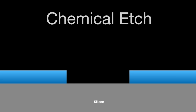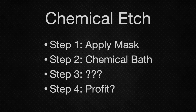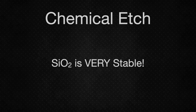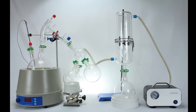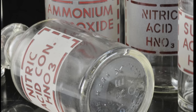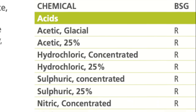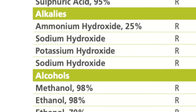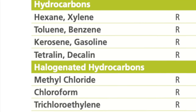So what chemical do we need? All we really need is something that will react with and dissolve the oxide layer. But as it turns out, silicon dioxide — glass — is very chemically stable. When you picture a chemistry experiment, all those flasks and tubes are made of glass for a reason: glass is resistant to or outright immune to pretty much any chemical you're likely to encounter. There is one notable exception, however: hydrofluoric acid, commonly called HF.